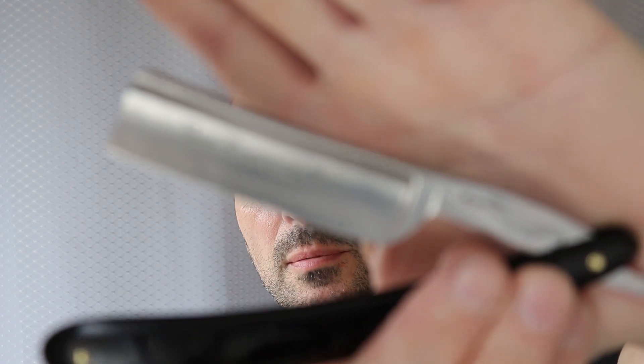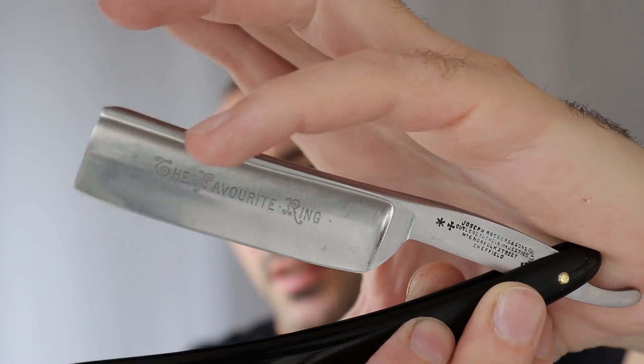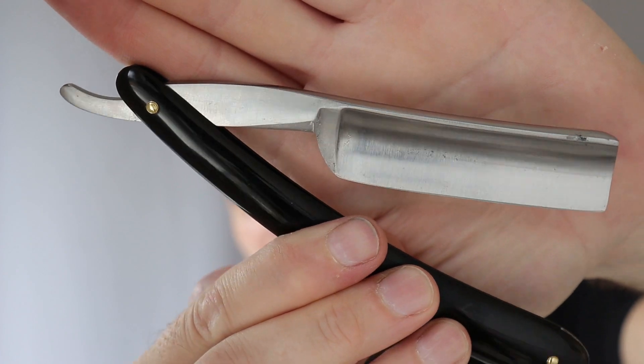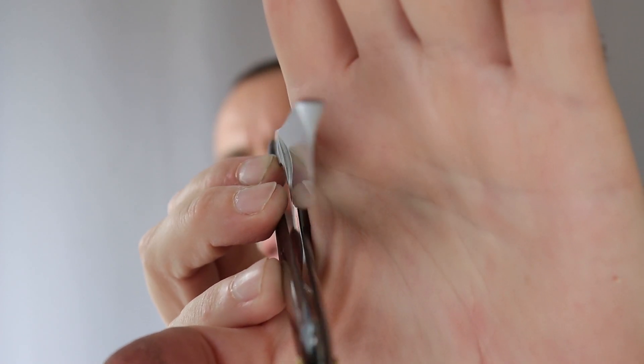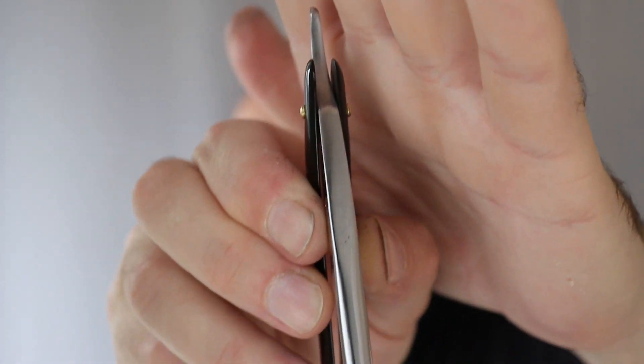You can see the finish I gave it — it was covered in rust and really in a bad way. So I did some grinding on it; it's quite difficult because you can only get a one-inch wheel in there. And unless the one-inch wheel protrudes — sticks out — which mine doesn't, and I've only seen a few that do, you can't really get the blade on it; you've got to be at an angle, so it's all a bit dodgy. But this went through everything really — I gave it a bit of greaseless and a bit of this and that and just ended up with a satin finish. Look at the grind on that — it was a 15/16ths, and that's a 7/8ths. But there's no belly on it, it's just a sheer straight grind. It's got a really thick tang and spine and it's long as well.